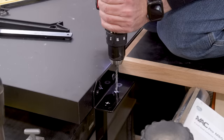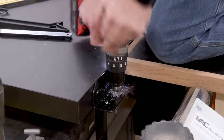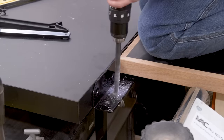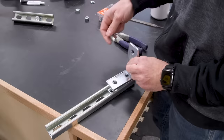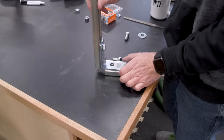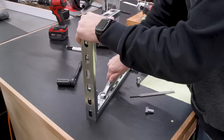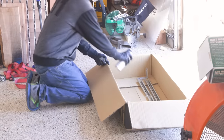The eight inch piece will be bolted directly to the table saw rail. It's a bit of an odd spot to work, so pardon the derpiness of my drilling technique. I'm just stepping up the drill bit size in increments until I have the final diameter that I need. I'll preassemble the bracket just to check my measurements. The branded nuts and bolts work really well with the strut system and look pretty heavy duty, so that's what I went with. This is just a proof of concept assembly, so I'll take everything apart to give the pieces a nice little paint job.